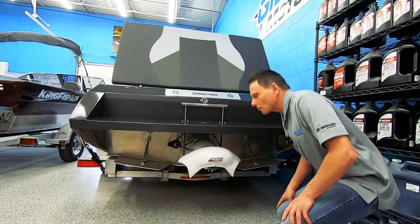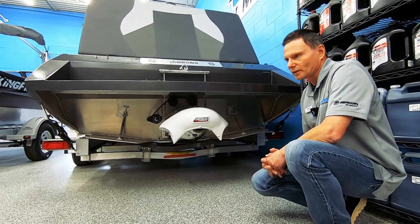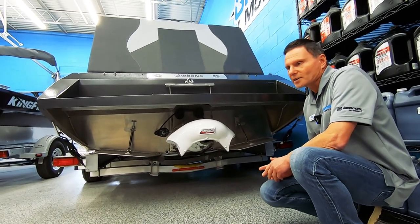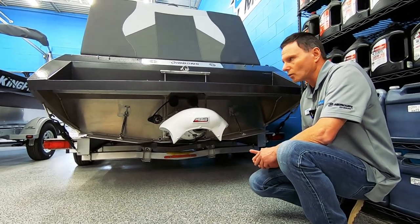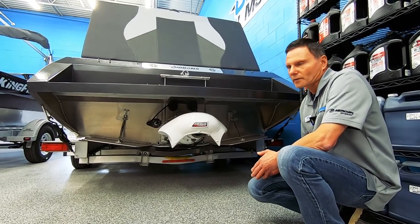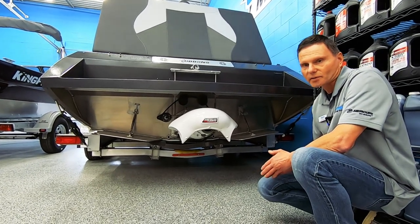We've chosen the SD309 pump on this boat for a few reasons. Number one, it costs less money up front. Number two, it is less money to service in the field. Number three, it's a quieter pump and it runs very efficiently. It's paired with a high-skew stainless steel impeller and the hookup with that engine works excellent. Our opinion is that if you're under 4,500 pounds total load — boat, people, and gear — the SD309 pump works excellent. If you're going to be carrying loads larger than that, then you may want to consider the Hamilton 212 pump.